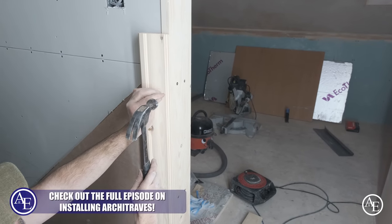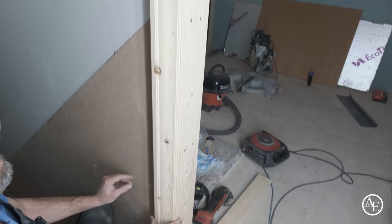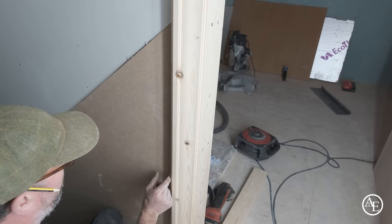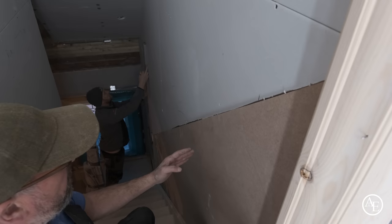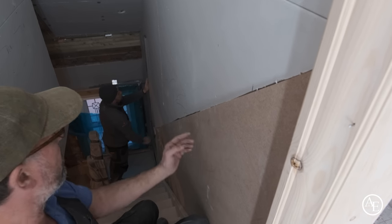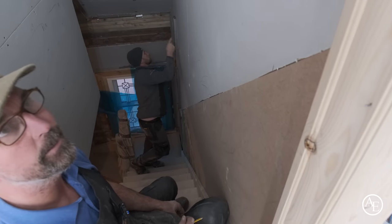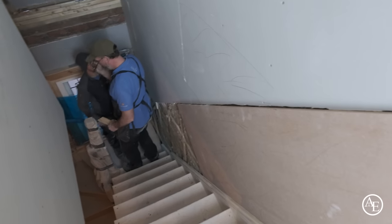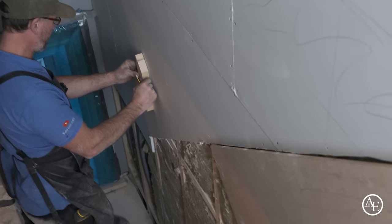Remember what I do, guys, spin the nail around. What I'm going to do is cut a 60mm piece of timber in here, and when I cut that 60mm piece of timber, that's like me upright. When Al's plumbed that up there, from there to there, I'll measure one of the panels downstairs and see how close I can get to it, so even it out and then mark everything up, because I want the join of the MDF to be hidden behind one of the uprights, so it makes it nice and neat. So that's the line, isn't it, mate? Yeah. And on the staircase down there, it shows that the timber comes like on that line, doesn't it, buddy? Basically here, doesn't it? Yeah.